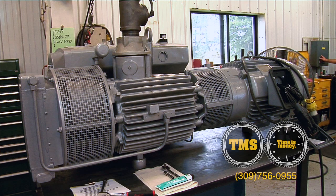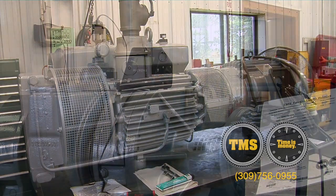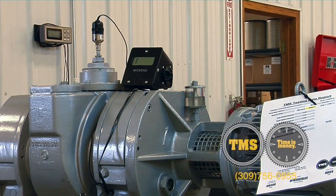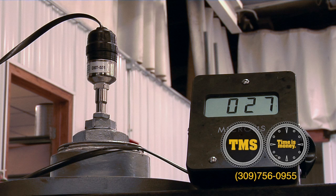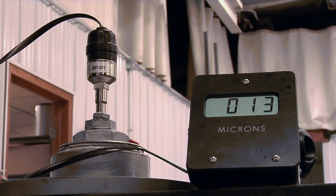The Panda booster must be tested in series with the vane pump. You may now start the vane pump and the Panda booster. Vacuum level on the Panda vacuum booster is read in microns when tested in series with the R5 vane pump. The spec on this is 10 microns.